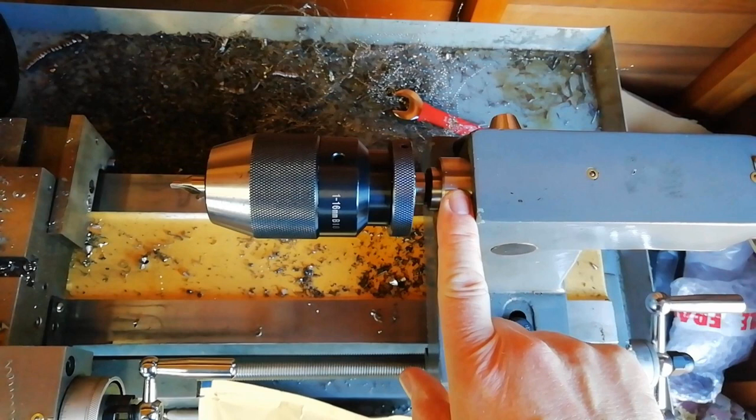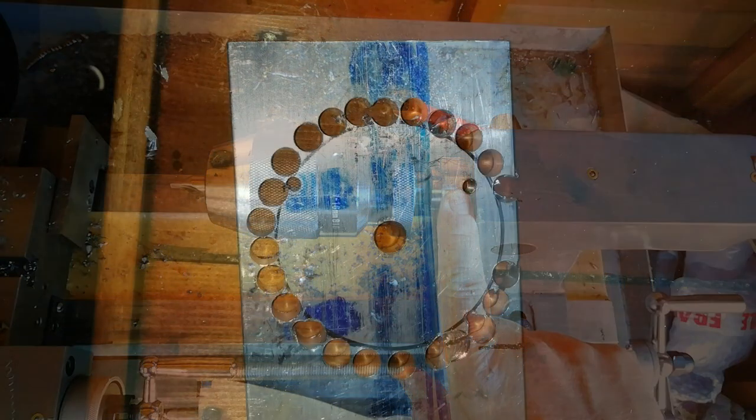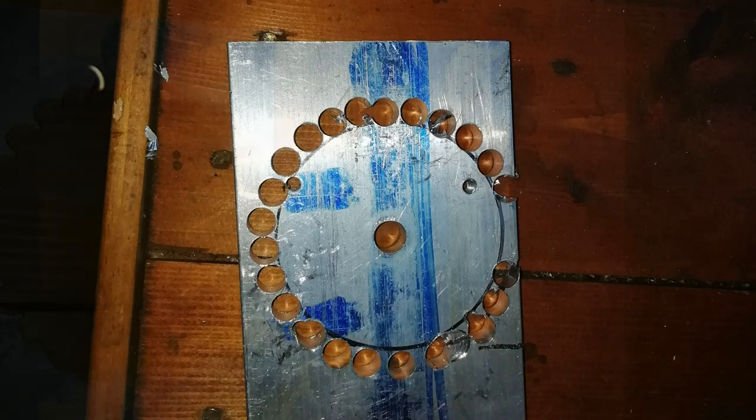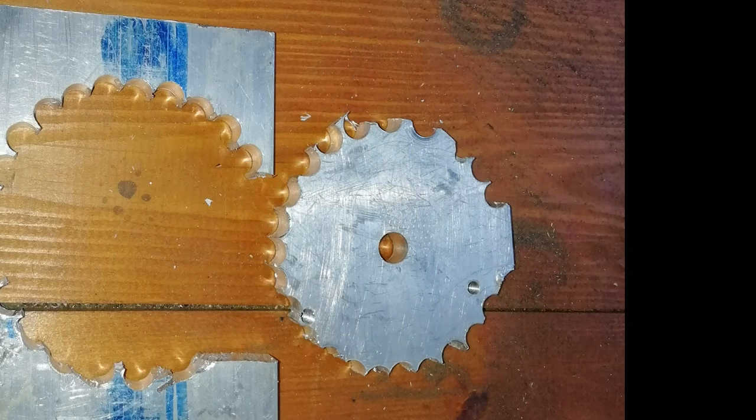I would machine an annulus — a ring — which would clamp onto that sleeve and attach one end of the digital caliper to that sleeve. While not much in the way of suitable tools, I was reduced to drilling lots of holes around the thing and working away with a hacksaw to drag it out of the blank.